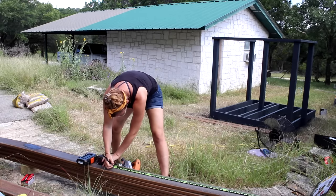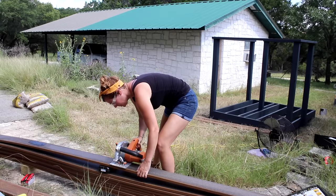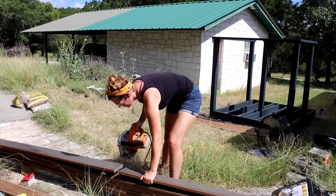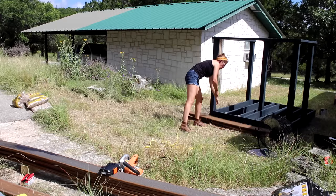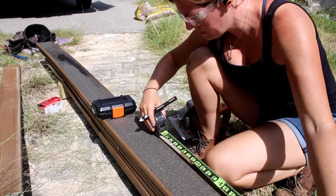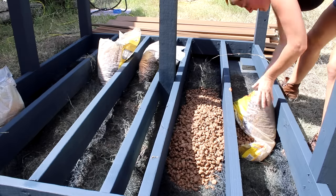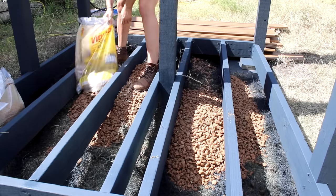While waiting for the paint to dry, I cut all the decking boards. I had Trex composite decking left over from my outdoor kitchen build — the boards were 12-footers, so I cut them in half. Check out the Crescent Night Eye tape measure for working in sunlight as it has an anti-glare coating. Before laying the decking I dumped a few bags of gravel between the joists to prevent erosion and reduce muddy splash-up.